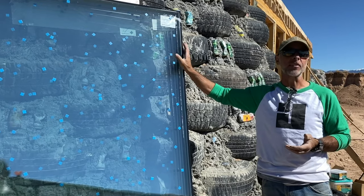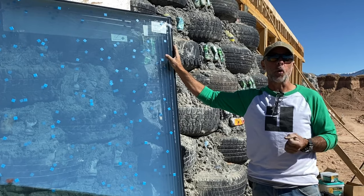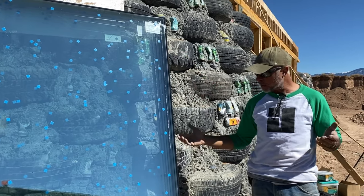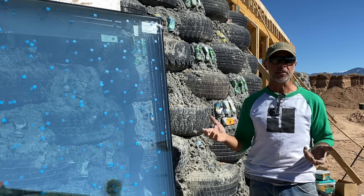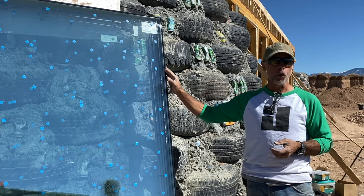Well, now that glass is going to these new prices, it might become a consideration more and more. Simply put, you just take an oscillating knife, cut the glass apart, clean all the glue, toss out the aluminum spacer, get a new one, new corner keys, and a box of desiccant.